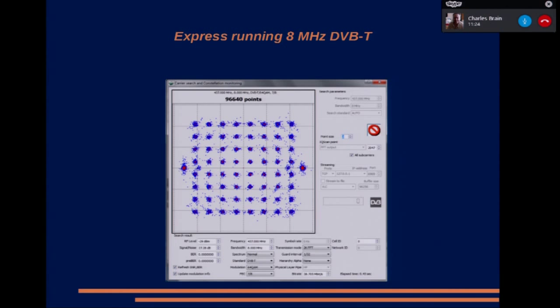Right, next one, please. Okay, now. In the States, DVB-T seems to be very popular, and there's a lot of people running high-def equipment, and it doesn't work too well with DATV Express. So we've been investigating this, and some of the problem seems to be due to the way USB 2 works. On average, there's enough bit rate to send the DVB-T signal as 16-bit samples across the USB, but every now and again, the USB 2 stutters, and we're getting dropouts on the DVB transmission. So I increased the size of the queue inside the FPGA. It's now using 85% of the available RAM on the chip, so I can't really go any further on that, and that appears to have improved it.